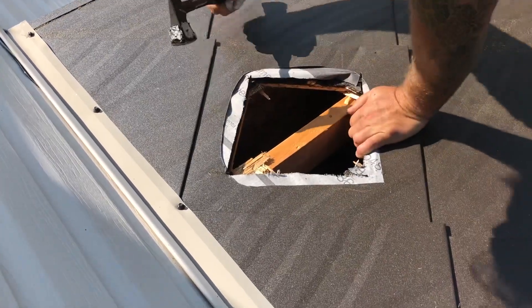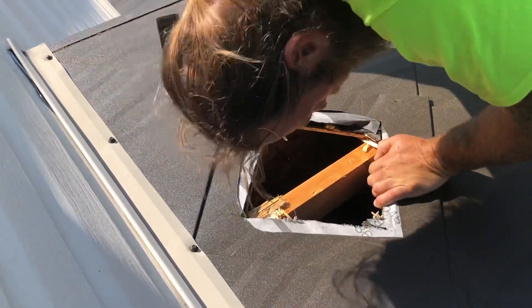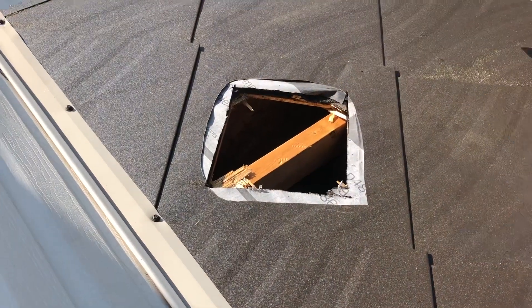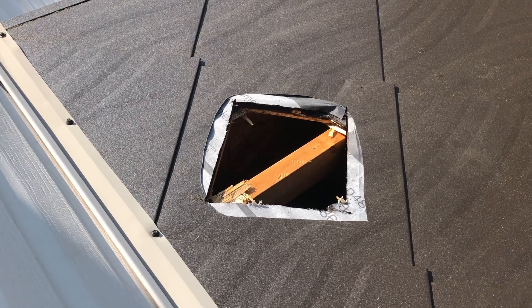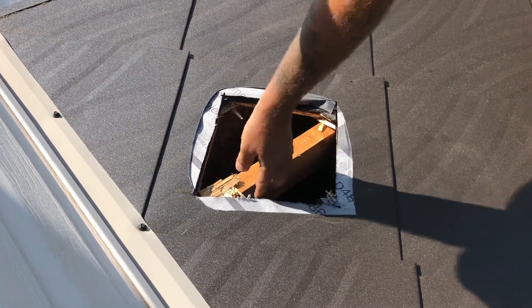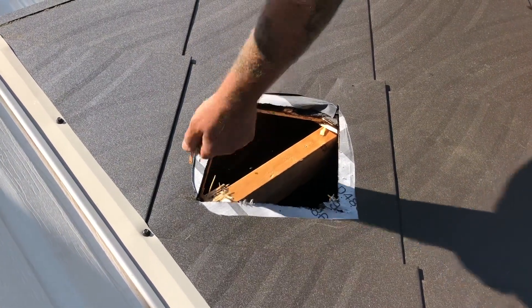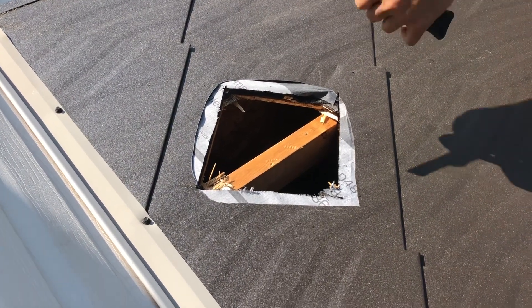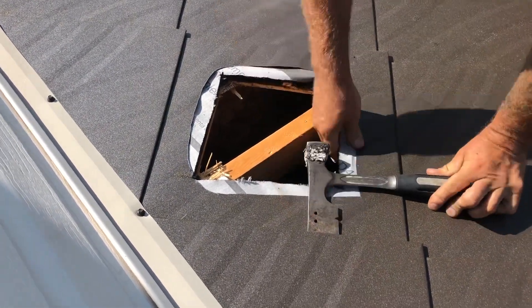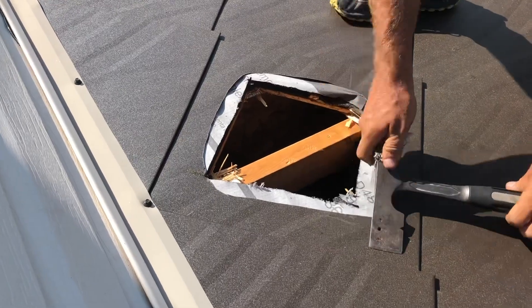See this space right here? This wall comes up and doesn't allow it to vent up into the other attic space. So what we're gonna do next is prepare the shingle to slide the vent up under — just pry that shingle up like so.